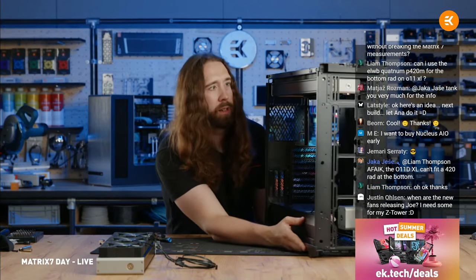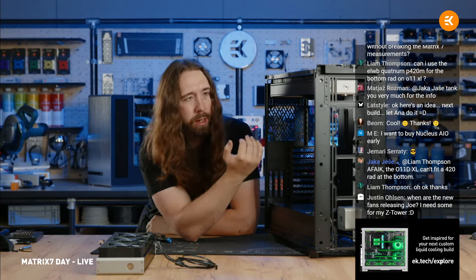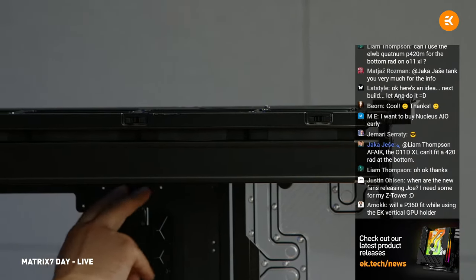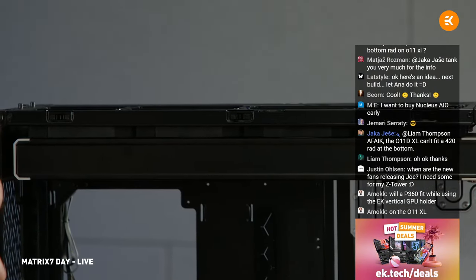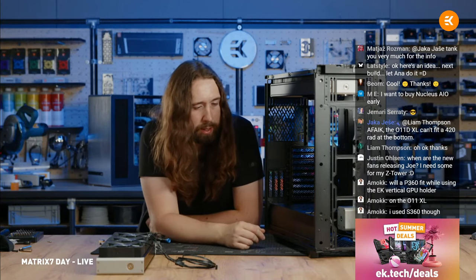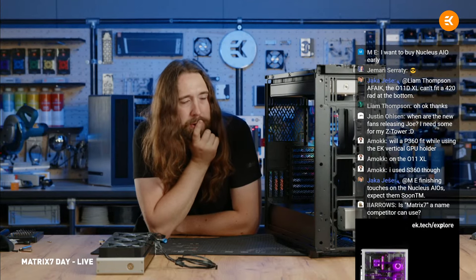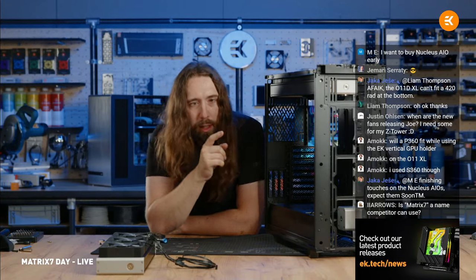So yeah, that's our P480 installed at the top. And as you can see, that's the biggest size you could put in this case. If you tried to go for an X, then the ports will be too low on the distro. And the reason we didn't leave enough space for the X was because the X would start covering the motherboard at the back. It would make life difficult for cables, and it would also interfere with the front radiator at the other end. So we've got P480 at the top, and this guy's going in the front. It's going to have the fans on the inside, so lots of space. And I think probably we should put the tubes on the top radiator right now while it's accessible. I'm just going to catch up with you guys.